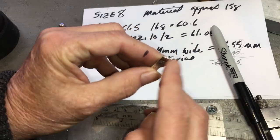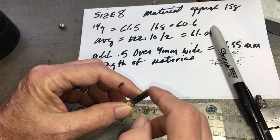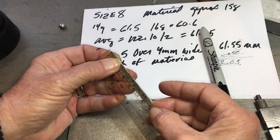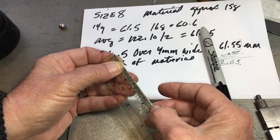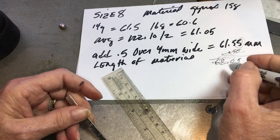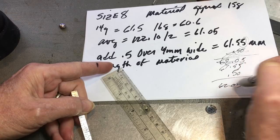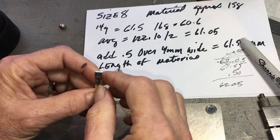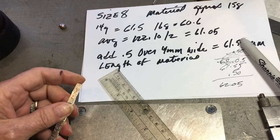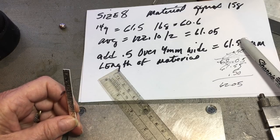What I need to do now is finish one of the ends and make it perfectly square. Then I'll take my measurement off of that square end and leave myself about a quarter to half a millimeter to finish the other end. You can add an extra half millimeter onto your measurement, making it 62.05. But I'm going to do it the other way, because that way I have less to adjust and it will be easier to get it closer to perfect size. If it turns out slightly too small, we can stretch it on the ring mandrel.